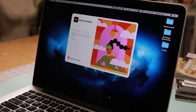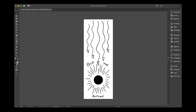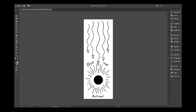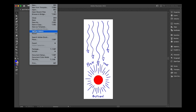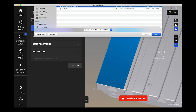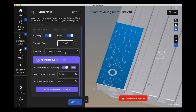Adobe Illustrator for iPad syncs your files seamlessly to the desktop version of Illustrator, so once I had a hand-drawn design that I liked, I moved over to my laptop to finish up the file. I needed to tell the machine what to cut and what to engrave in my design, and Bantam makes it pretty easy to do this with their advanced SVG workflow. You can use colors in your vector art program to assign different types of operations to parts of your design. So I colored the mounting hole red to mark it as a cutout, and the rest of the design I colored blue to mark it as engrave. Now when I open up the file in the Bantam software and select Advanced SVG, the software automatically knows what to cut and what to engrave.